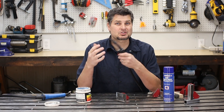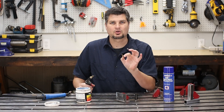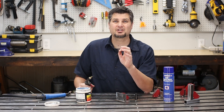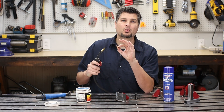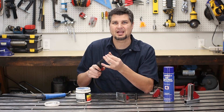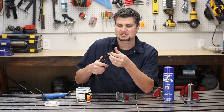When you're welding, your tip and your nozzle are really close to the weld. It accumulates all that spatter, gunk, and everything. With the flux core nozzle, you really only care about the tip. And when I first started, I got these gunged up so quickly — it'd be really frustrating, because you would just be able to weld a little bit, and then you'd pull the trigger, and nothing would come out. It'd be all balled up and stuck on there.